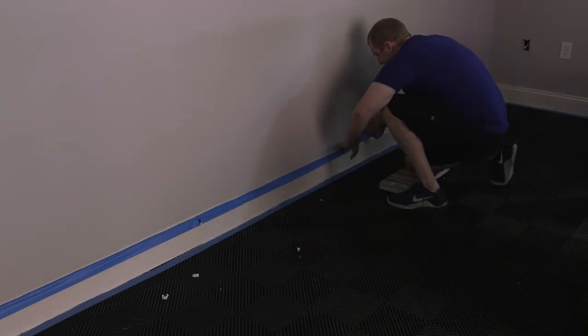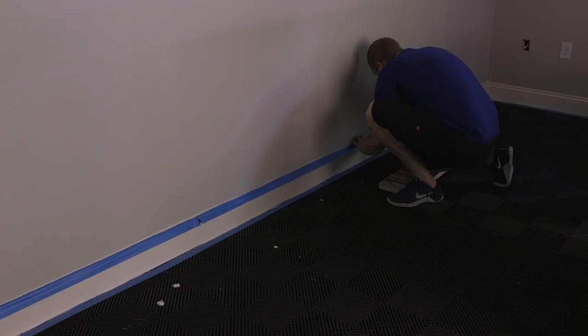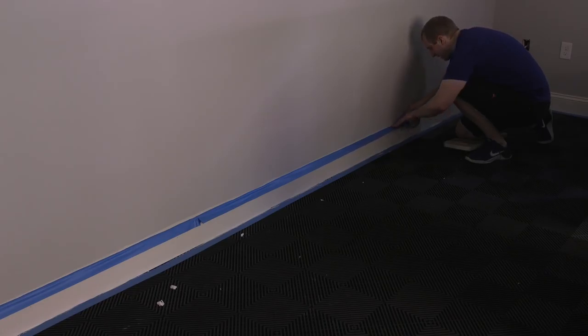And I don't think many professional painters tape. They just edge it. This is just one of those spots. Like, I wouldn't tape a ceiling. I would just edge it with a brush, with a 2-inch angled brush. But on the floor, the lines, to me, are more important. I'm always looking down. For some reason, I'm always looking at baseboards.